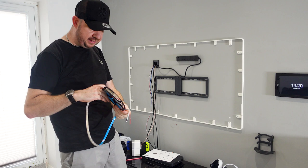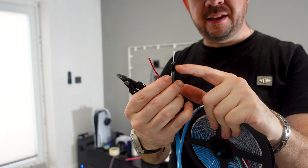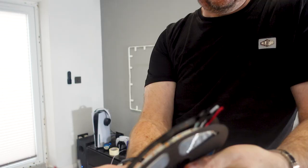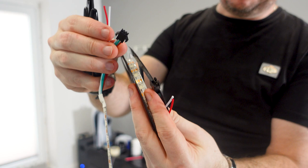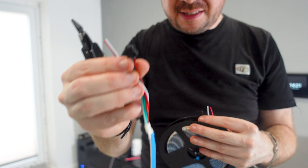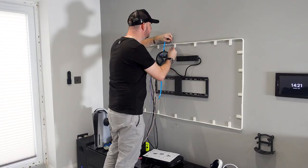This is the 60 LEDs per meter tape, and this is five meters of it — so there's a lot of LEDs here, which should give me a really nice glow. There's a direction to this tape. The easiest way to tell is this connector — that is the male versus this one that is the female. This is the starting point, so it will head off in this direction. Either way, it's this one that's the starting point in the chain. I'm going to cut this off so I can poke the wires through.